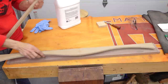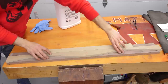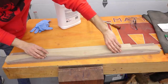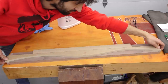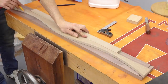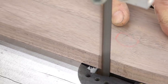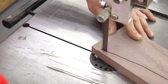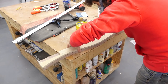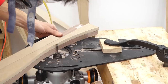So I have my little template here, which is obviously narrower than the workpiece. To make alignment a little bit easier, I cut this little strip which I can stick onto the back and line it up with the back edge, and now I have my rotational alignment correct. All I have to do is worry about my left-to-right alignment. I have a center line I could use, or I can come over here and verify that I'm protruding the same amount on both ends. Right now I'm just doing rough material removal — I'll trace around the template and roughly cut it out at the band saw. When I actually stick the template down to do the flush trimming, that's when perfect alignment matters. I'll do this first one, flush trim it to the template, and this will become my new template for the other two dividers. Once we get through those, we can pull the case apart and start working through its curvatures as well.